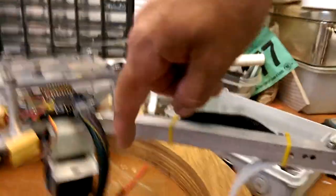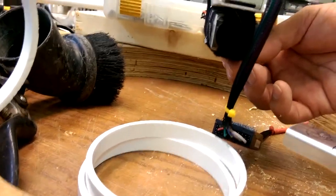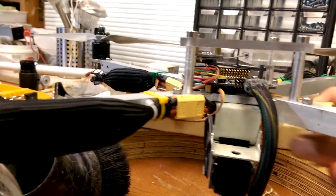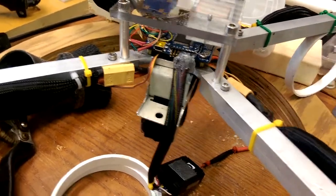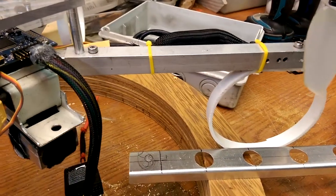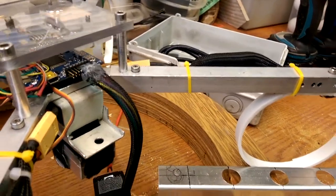I have to figure out a mechanism at the center because I don't want to add any depth underneath the battery, so I would have to mount a servo here. That would mean some sort of a linkage to go around here, which probably means some kind of a circular assembly. When I move the circle it will have an eccentric and it'll push out — or pull in — the landing gear rod to extend it. I'll have to give some thought to whether it should be pulling in to retract or pushing out to extend, or vice versa.